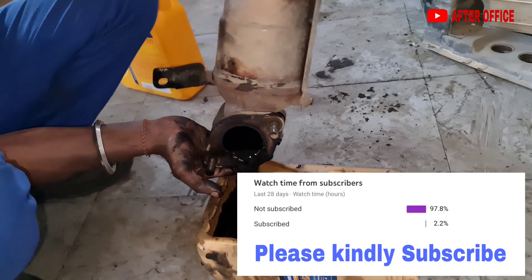We are now using the water from the other side — you can see water coming out, which will clean the entire engine oil from the exhaust. The turbo is back from repair — they have put in a new impeller. That is the intake and this is the exhaust side. The impeller is quite tight with no play, so the turbo is as good as new. We will fit this turbo and then check if there is any other defect in the engine.